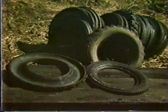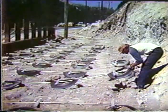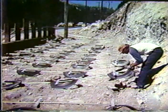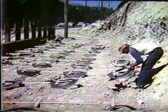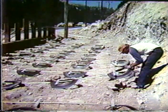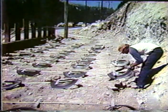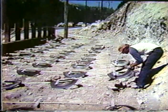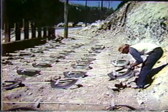welded and then a little bit of galvanizing placed on it to prevent long-term corrosion. And then the use of tire sidewalls, it really doesn't matter, they can come in all different sizes. And then here are the cross arms to this tieback bar that's laid in the fill to which the tire sidewalls are anchored. And as I mentioned earlier, the state has run pull-out tests, and there's tremendous resistance to pull-out with the added strength and passive resistance provided by the tire sidewall.